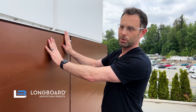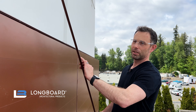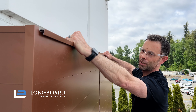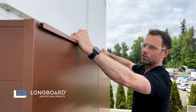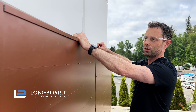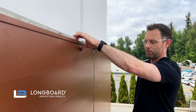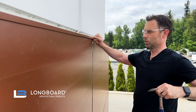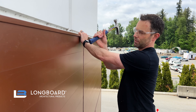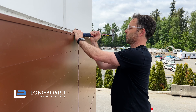The next step, after we've got the plank in and the base in place for that termination set, we take our cap. In this case we're using our precision cap — that's the 5/8" cap. We line it up with our base and simply snap it in. If you don't have the ability to reach around to the trim, you'll just use a block and hammer, rubber mallet, or the butt end of a swinging hammer — that serves quite well.